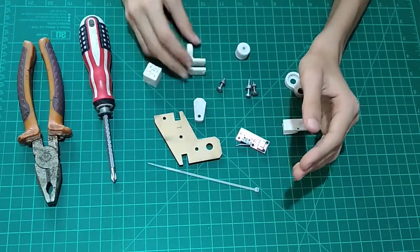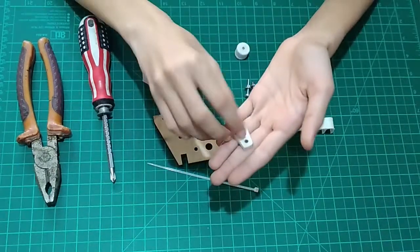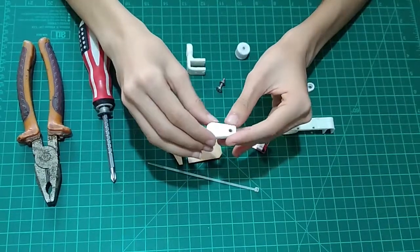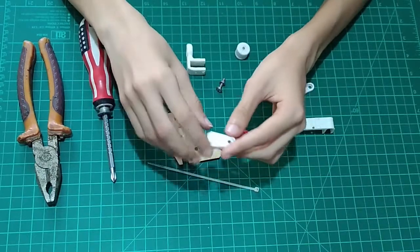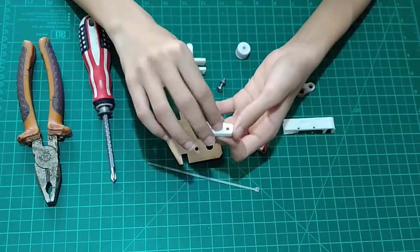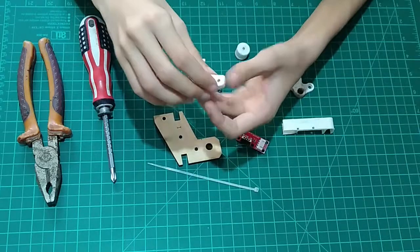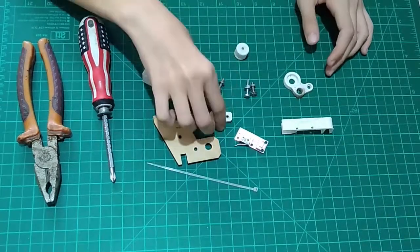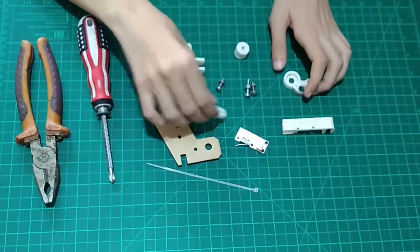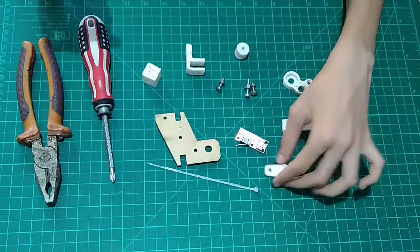We also have this part which got lost while I was buying my frame for my Creality Ender 3 printer, so I got a picture and made a model for it and 3D printed it. Link for the video where I made that part in the description. I just wanted to talk about it because it's a very important part, as it goes right here and holds the smooth rod of the Z-axis from getting up and down while it's moving.